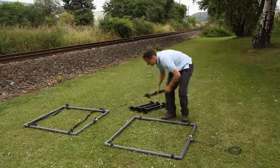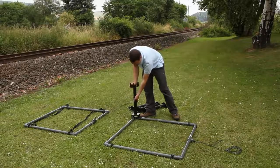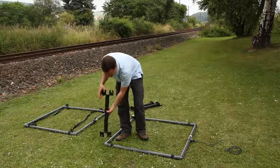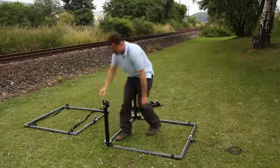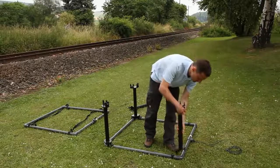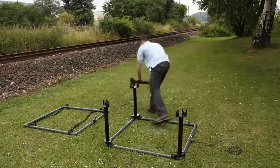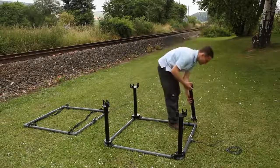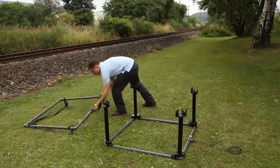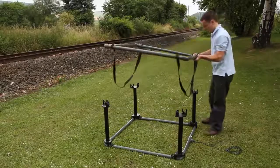This specially designed double frame coil consists of 2 coils working electrically in opposing directions, thus suppressing interferences, for example from power cables. In order to achieve this, make sure that the marks on both coils point in the same direction and that the lower coil is connected with the marked connector of the Y-shaped adapter cable.